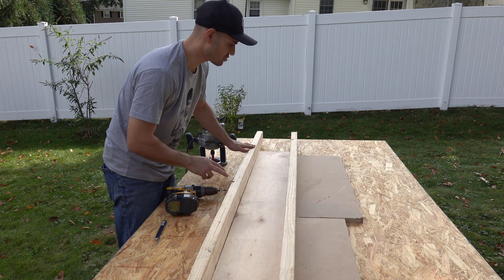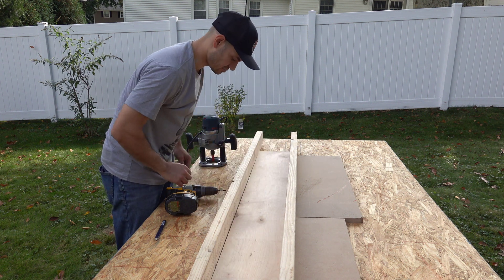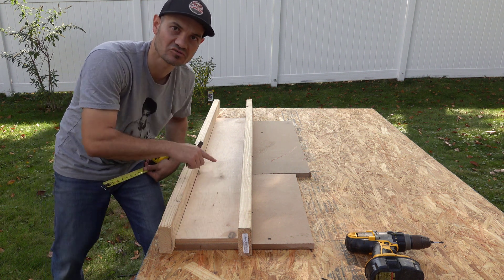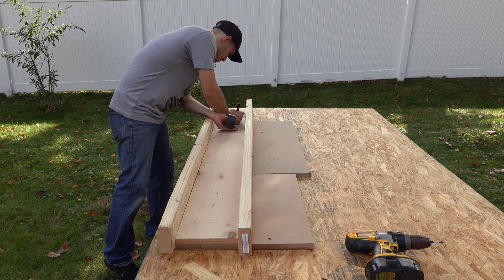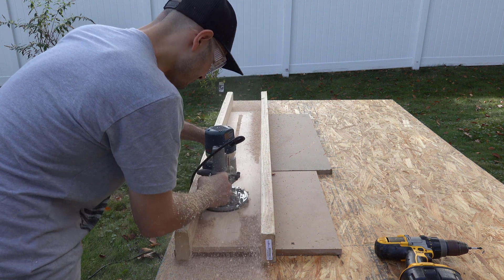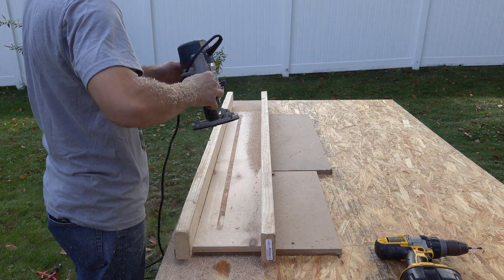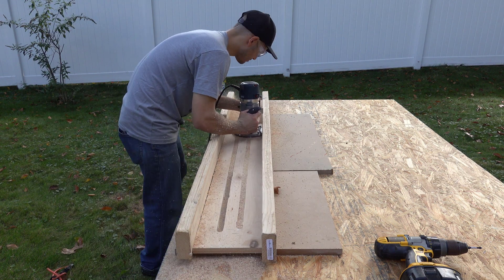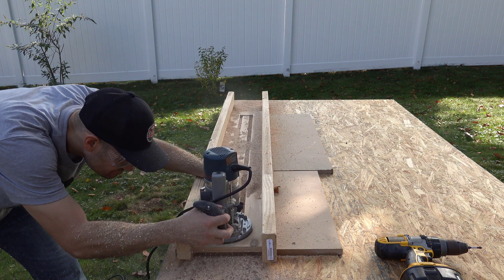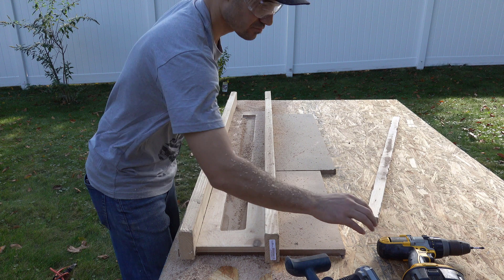These guides are just temporary — just to make the slit within the sled. I'm going to screw these to this piece of MDF to lock it in, then slide my router up and down to create that slit. I put three screws in on each side to lock the form in place, then run the router in and out to create the slot. I'm going to stop boring out that hole at three inches on both sides.